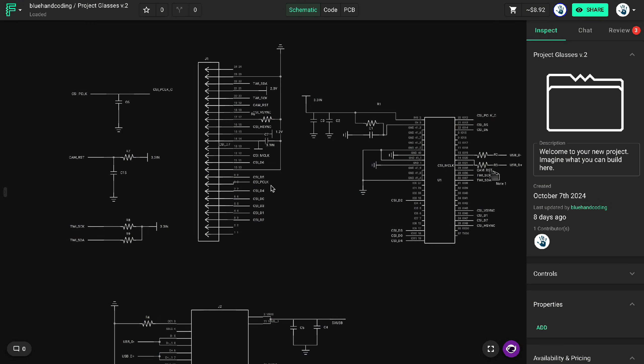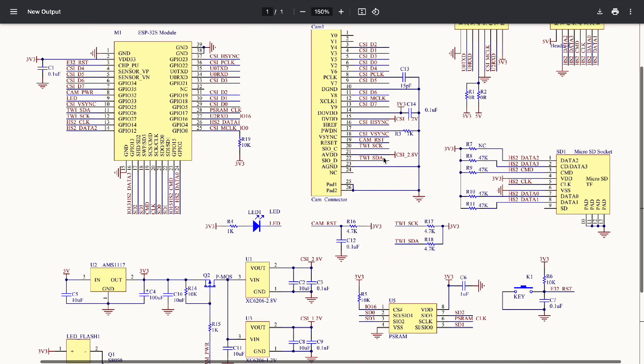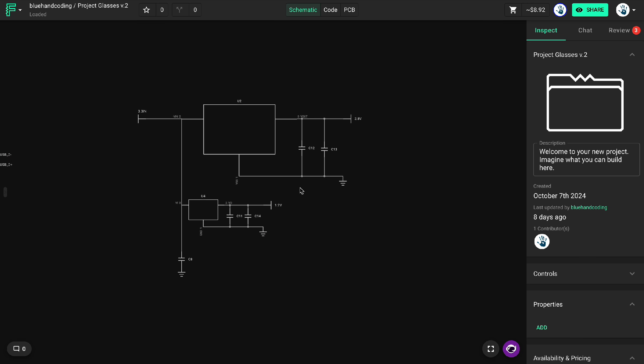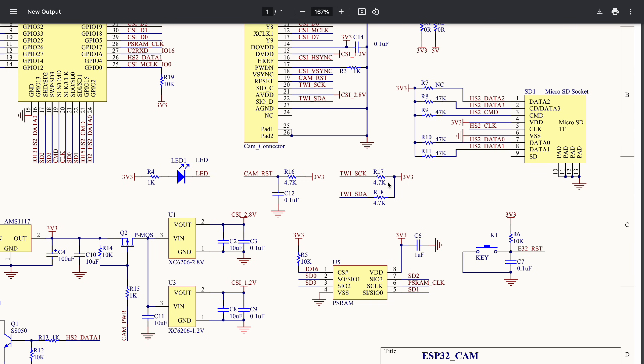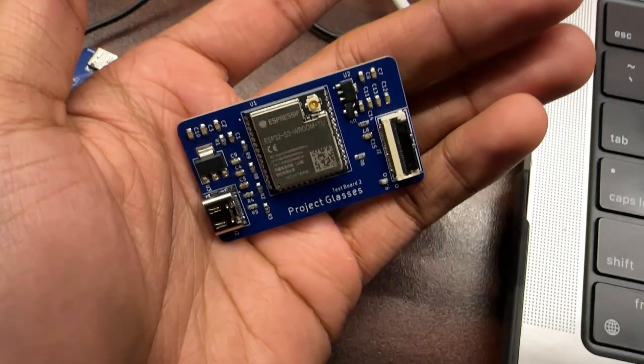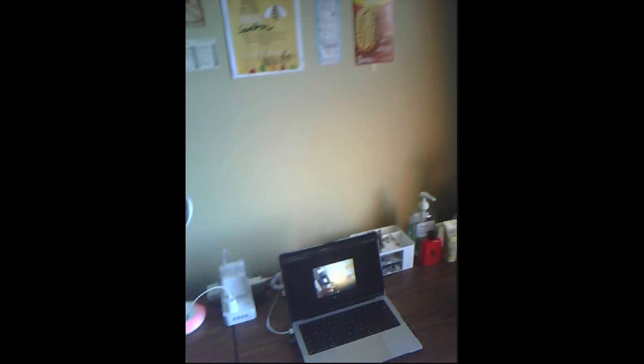The point of version 2 was to take what I learned making the ESP32 work and then add camera functionality. I referenced the ESP-CAM datasheet heavily — the second iteration basically just copies an ESP32-CAM schematic. All I had to do was flip the pins on the connector and add solutions for powering certain pins: 2.8 volts and 1.2 volts, as you can see with the ESP32-CAM, plus I2C data lines and the reset. PCBWay came through so quickly — I had the design done at the beginning of the week and had it in my hands by the end. There were a couple of issues with pinout on the CSI connector — I thought it was flipped, then thought it wasn't, but I'd had it right the entire time. Other than that, I just had to add additional capacitors and resistors and make the board a little longer. Here's some footage of what it looks like when I was streaming — it's honestly not bad, but it struggles in low light and sometimes there's latency from the stream.